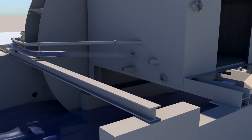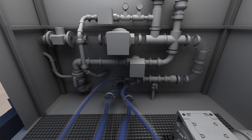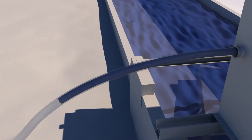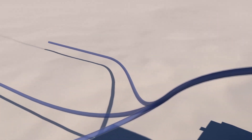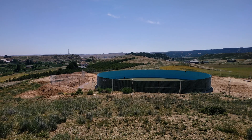After this, it goes to the pump and then through some valves that regulate the system. We also measure the flow rate and the pressure. By bringing the water to an elevated reservoir where we collect it, we can have enough pressure to irrigate a field that is lower. This reservoir is 30 meters higher than the pump and 860 meters further away in horizontal distance.